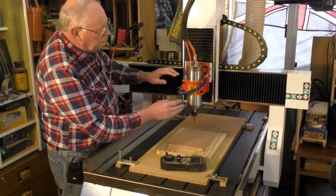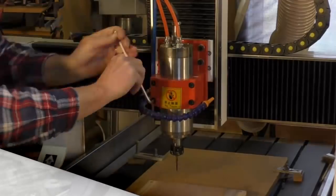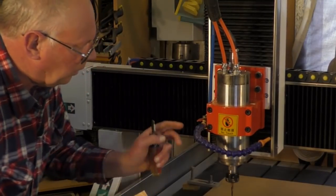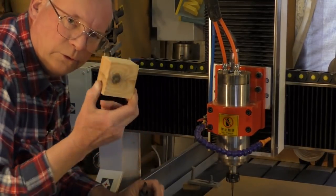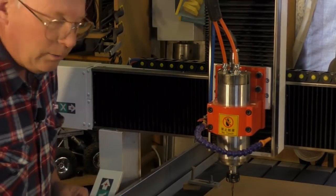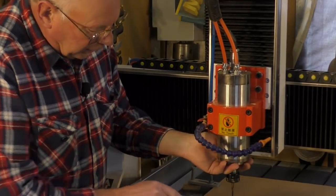What I'm going to have to do now is actually reposition the router head spindle, because it's not going to reach down far enough. A little tip: before you unclamp this, get a block of wood — just an old piece — and put it underneath the tool. Don't put your hand directly underneath the tool, because if this drops it's probably about 10 kilos and it will go straight through your hand. I always catch it with the shaft between my fingers like that, but I also back it up by putting something underneath it.